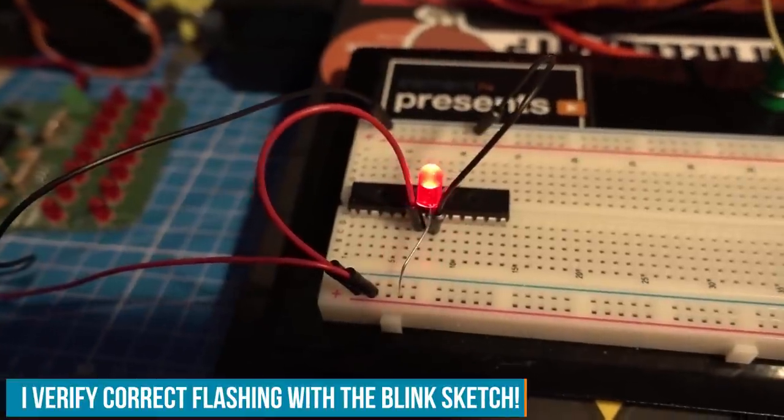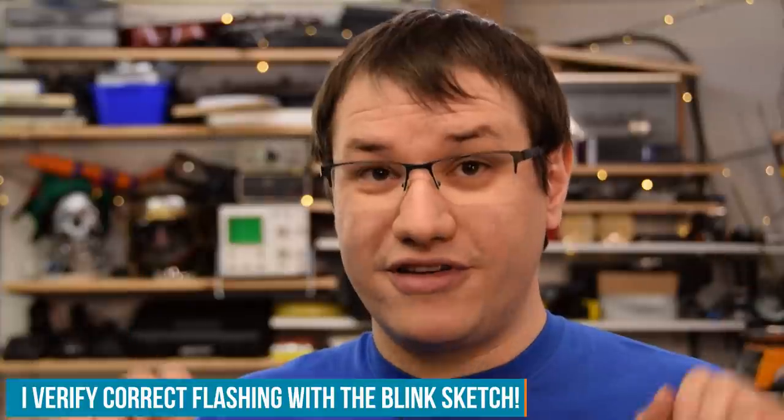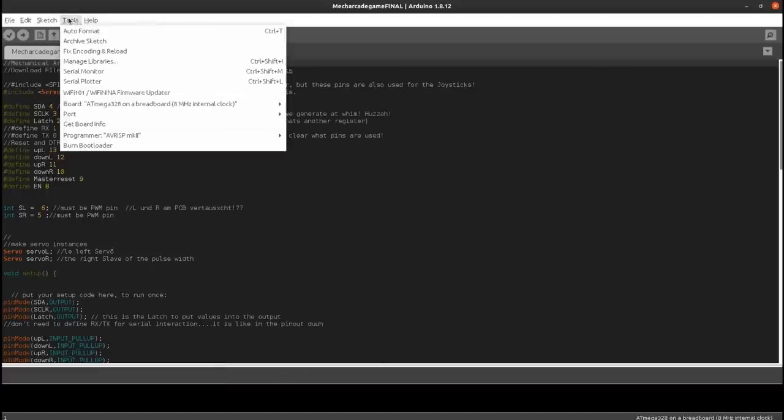So what you need to do is make that ATmega328P work as a standalone unit and use its internal 8 MHz clock. So what you need is the board file for the Arduino IDE. There's a link in the description to the Element 14 community where you can download such a file. Import that into your Arduino IDE. And that is what you're using to flash. But you are not flashing with USB upload.